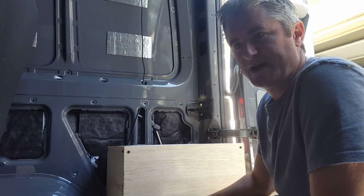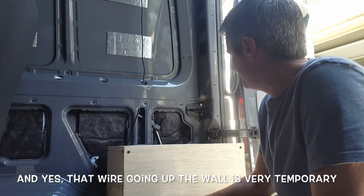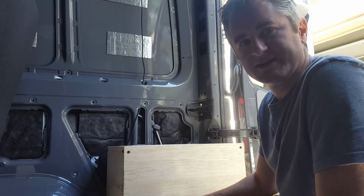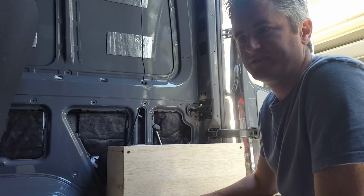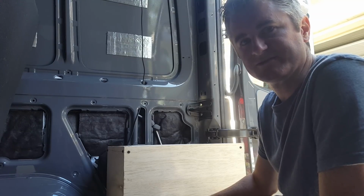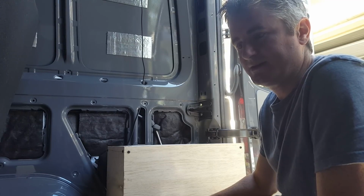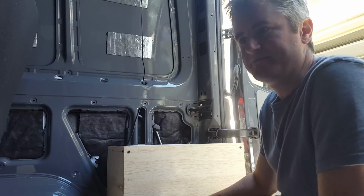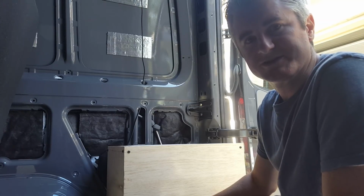I mainly wanted to give you guys a little bit of background on how I use my van, why I chose lithium, at least gave you a glance at how I have this hooked up and what equipment I'm using to charge it. That's the biggest struggle that I had when I was looking at lithium, was trying to find equipment that could safely charge a lithium battery. I was not able to locate a lot of hardware that was meant specifically for lithium, and I had to look really hard to find equipment that had adjustable, programmable charge points, because that's probably the most important thing to take away from this video, is make sure you use equipment that will charge to, like, say, a lower voltage than what you'd have with lead acid.